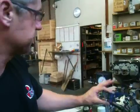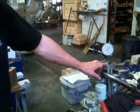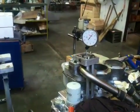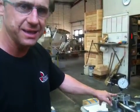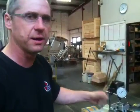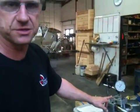Now the problem is, the Jabiru engine — as you can see here, we've put a dial indicator on it — has a valve lift. I've put a solid lifter in this engine temporarily and we've measured the valve lift, which is around about 9.8 millimetres — let's call it ten for safety. So that means when building a hydraulic engine with our liquid-cooled heads, you must make sure you've got at least ten millimetres of valve movement before the spring binds. You can check this by manually moving the rocker with a lever.